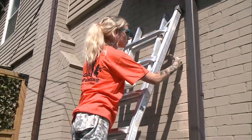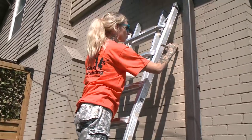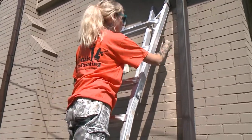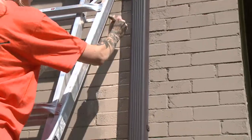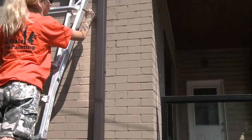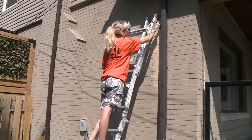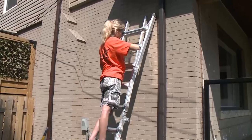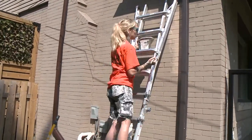What if I was painting siding or like a limestone — is it different? No, the limestone you would probably use the Permacrete as well. But the vinyl, like we have at the front here, vinyl's a little more tricky. You need to use certain colors. So when you have a color like Renee has that's sort of a taupe, you can't go any darker. You need to go lighter because when it gets trapped under a darker color, it can warp the vinyl.